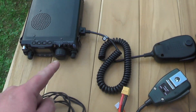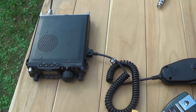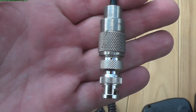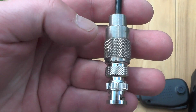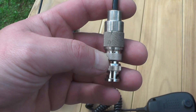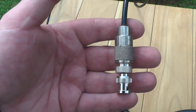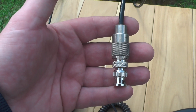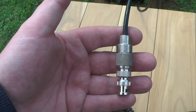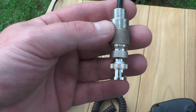I've had this battery in the FT817, used a yagi antenna and it states on just 5 watts. If you want to run a longer cable on the Arrow antenna, you can just use some PL259 cable — ordinary RG58 cable with PL259 connections on the end. And you've got the BNC plug there which fits into the Arrow antenna. You can also use a Comet diplexer on the Arrow antenna as well. I've got one somewhere; I haven't actually played with it yet. The cables tend to break on the Arrow antenna after years of putting them in and pulling them out. I've seen a lot of YouTubers that have got their own cables plugged in and also got the diplexers, so I'll try mine at some point.